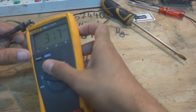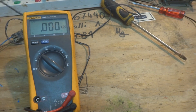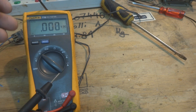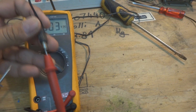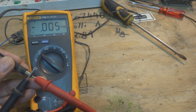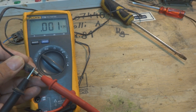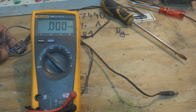I'm going to test it on the meter — voltage DC. I have to connect the two probes: inside is positive, outside is negative. As you can see, it's showing zero volt — it's not giving anything. So I have to test the input side as well.